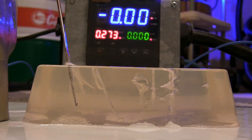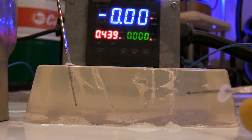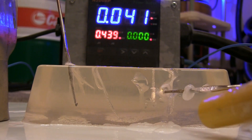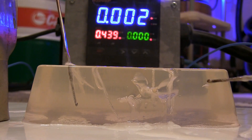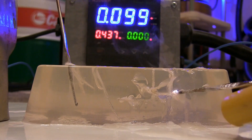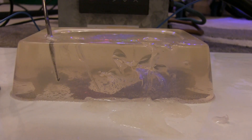What do you want — 415? 440? 500? We'll have 440. At these voltages our flesh and our skin cannot hold that sort of voltage back. That's when we start to get dangerous levels of current which is dangerous to us. That there is enough to kill. Cool — that stinks. That's going to be messy. So that little demonstration is the low voltage side covered. I think we need to go to medium voltage next and then proceed to very high voltage later on.